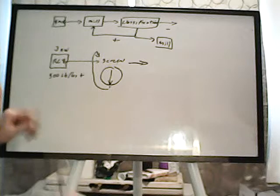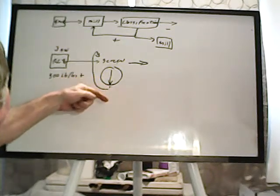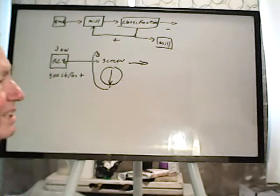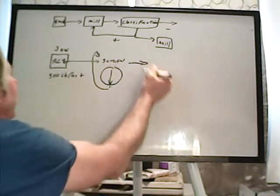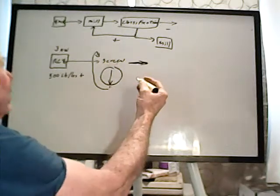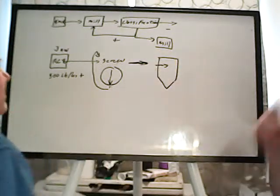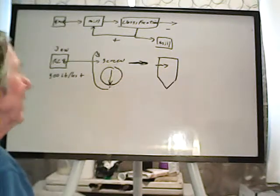But again, you have to start somewhere. You know, you could even maybe take a chute coming out this way, and then the conveyor going up that way, and then another chute coming back. There's lots of different ways to play that game. But by doing it this way, you have your fairly tightly classified material with minimum undersize going here, and then you're not wasting energy on it again, or even more undersizing it. And then to the agitation tank, and then from here to the tailings pad.